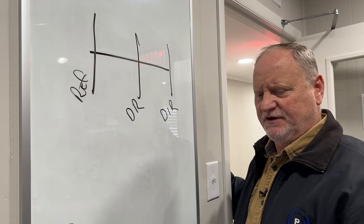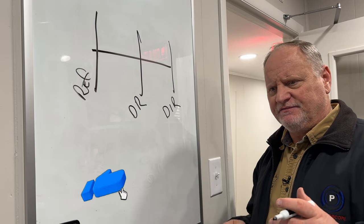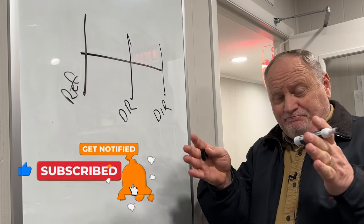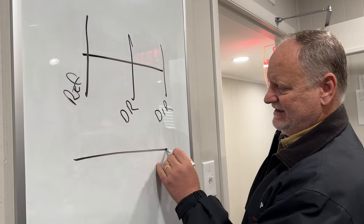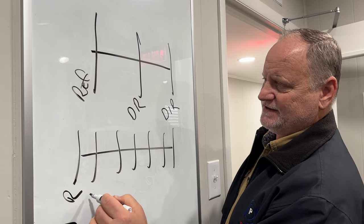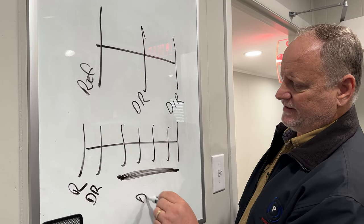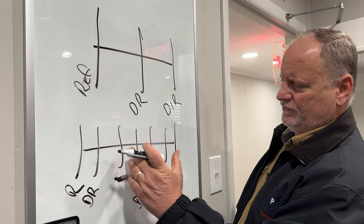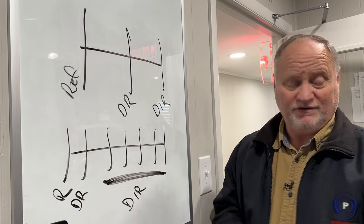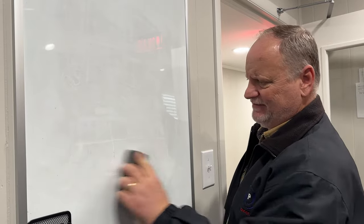A three element antenna is great, especially if you're not going a great distance. But what we want is an antenna that gives us the most possible range — one where the beam is going to be pretty narrow. We want to build a seven element antenna. It's going to have a reflector, a driven element, and then all the rest are going to be directors. The more director elements you have, the more that beam gets really narrow, and that's what we want.